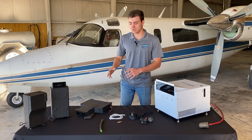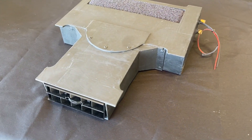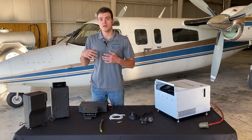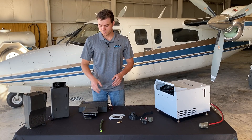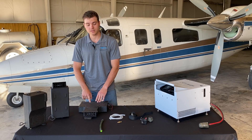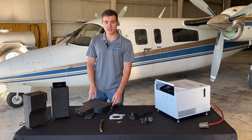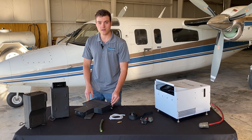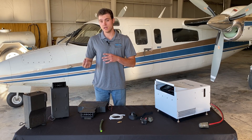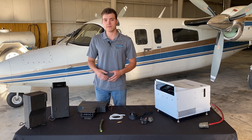Going over the cooling modules: this one in particular is the underpanel unit. Of course, we have our adjustable vent up front. This is typically sitting flush with the front of the instrument panel. We then have mounting surfaces across the top, and you have your fresh air intake on top. On the side of the unit, we have your liquid connections and your fan wires. On this system particularly, we provide a condensate drain that will be connected dependent on the aircraft and the installation.